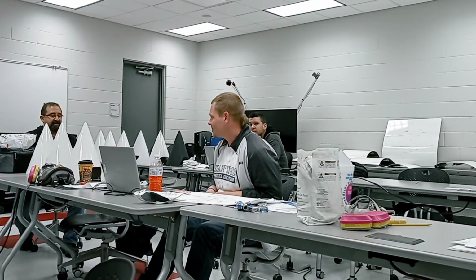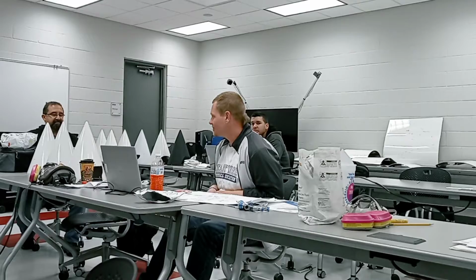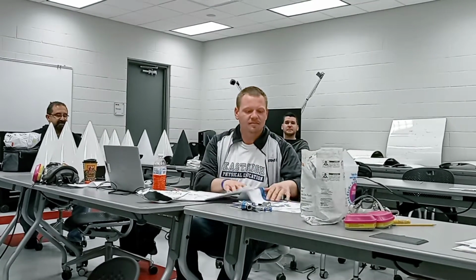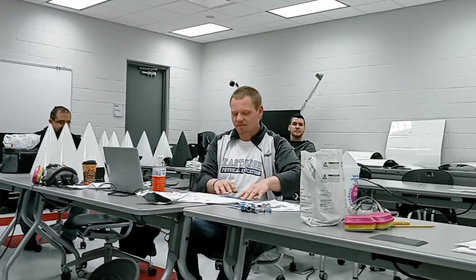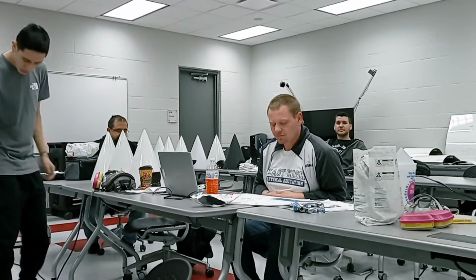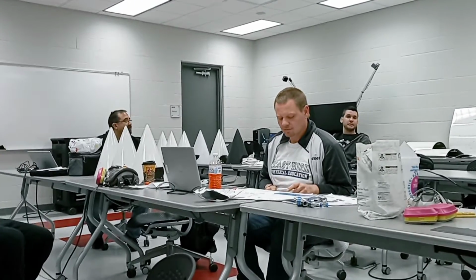A coating is 75% solids by volume, assuming 100% transfer efficiency. 8 mils of wet paint will dry down to how many microns of dry paint? Select the closest answer. Hold on, man. Where's that sheet? 50 microns, 6 microns, 200 microns, or 150 microns. 150. Am I right? I said 150, no, first I said 50.